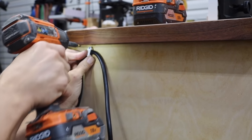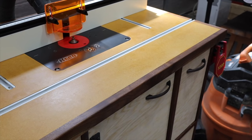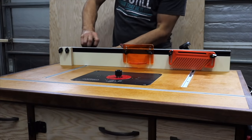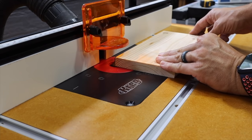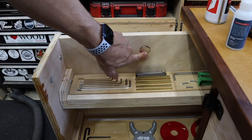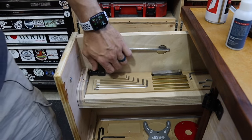Then I routed those cables with some cable ties and drilled a hole in the back for the power to come through. Power on! I got this fence from taytools.com — it runs about a hundred dollars, I'll drop a link in the description. It's a really good fence for the money — you can have an offset fence on each side, it's got a bit guard, dust collection, the whole nine. Next, it was time to organize the router bits into the router table. I used a Forstner bit to drill a hole and stuck a rare-earth magnet in there with CA glue — now my adjustment wrench has a place to be stored vertically, out of the way, for quick and easy access.